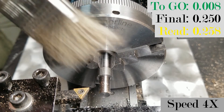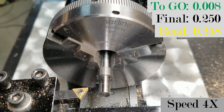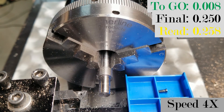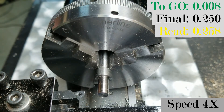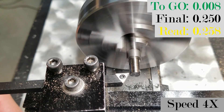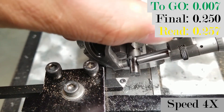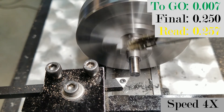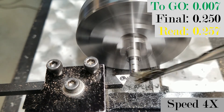I'm going to go ahead and clean up — still in the experimenting phase. This is only about the second time I've used the steel inserts, so using this little tray because these fidgety little screws are not good to lose. I'll take a moment to clean — actually quite a lot of phosphor bronze got in underneath there. Now I've got my high speed steel insert. I'm using the journeyman tip to touch off and re-zero my hand wheel, then take another measurement. You can see that since it cooled down it changed ever so slightly. I'll take a skim cut after zeroing.